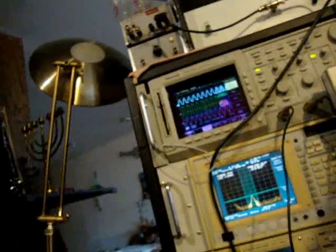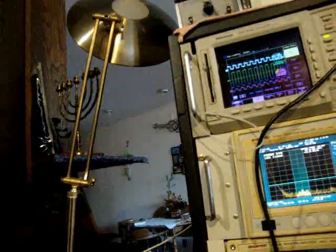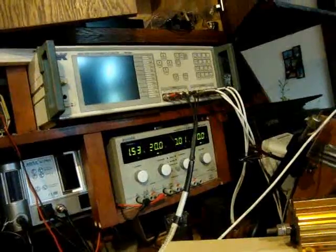Nice spark! I'm looking at the waveform and the changes when I spark. I see a voltage drop but there's not much distortion. When I only touch that wire the current rose to 1.6 amps, and when I release it it drops to 0.77 amps. This is an indication that I'm giving extra capacitance from my body.